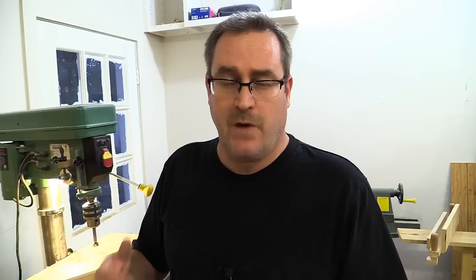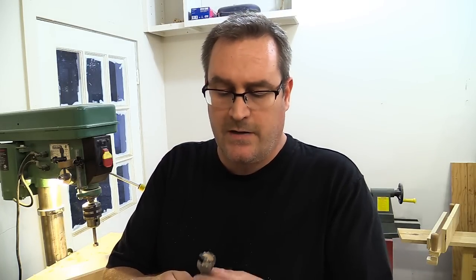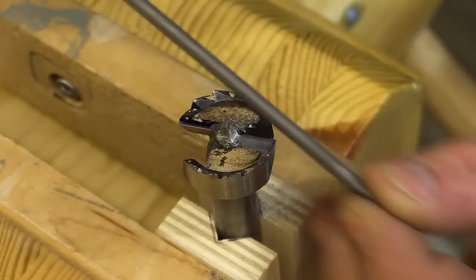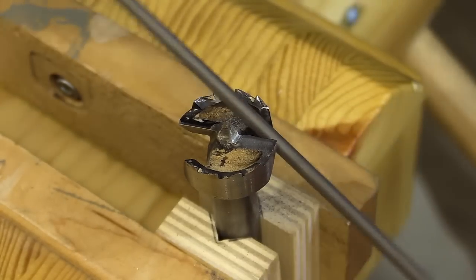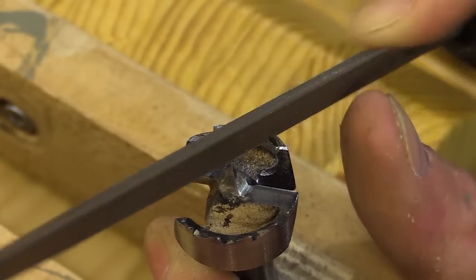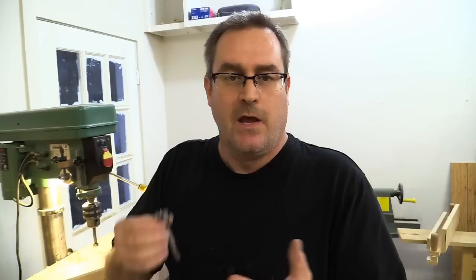So that was a three-quarter inch, lower-cost bit. You might be wondering if this works on a better model — I have a Freud set that I tried to sharpen and had no problem with that either; the files cut in without any difficulty. Also, if you have a bigger bit that has teeth, you file them the same way: work on the round part with the round file, then file each individual tooth. What you're looking for is to thin out that edge where the teeth are, so it won't take as much round file work, but you'll have to do a little more triangular filing. Just watch out that you're not hitting something else when filing — angle the file upwards when working on the teeth. And if the file cuts in a little bit on the side, it seems to make no difference whatsoever. Anyway, that's it for this one — I hope you liked it and thanks for watching.